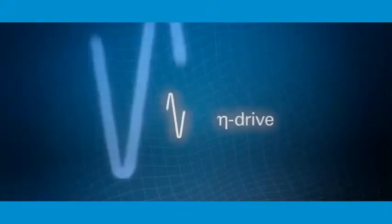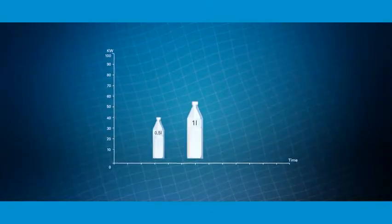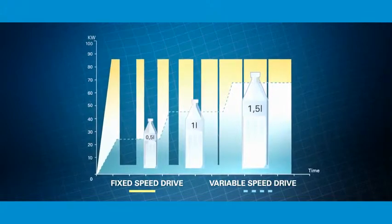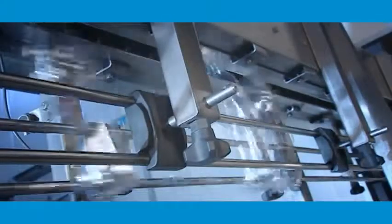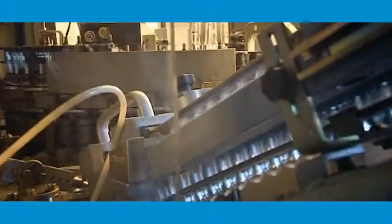With the ZD compressor, it's all variable speed drive, screw compressor, dryer and booster. The variation spans very wide, between 40 and 100% of capacity, exceptional compared to other machines on the market, maximum energy saving. And with variable speed drive, the output pressure is also constant over a wide capacity range. There's no current peak at startup, and you can avoid penalties from utility companies. I can make a complete simulation of your energy savings if you like.